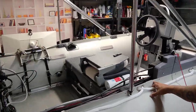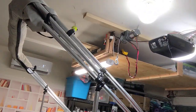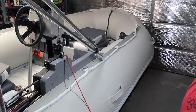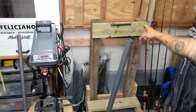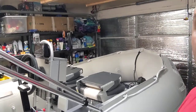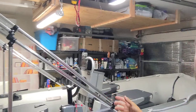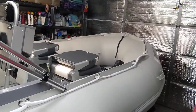When I do deflate the boat and take it apart, it literally takes me an hour. The console and motor all come off at the same time. I have a winch installed on my ceiling, which helps me lift up the actual outboard and put it on my homemade engine stand. I also use wide yellow truck straps from that winch at the front and back of the boat underneath it, lift it completely off the trailer, drop it on the floor, and I can deflate it completely.